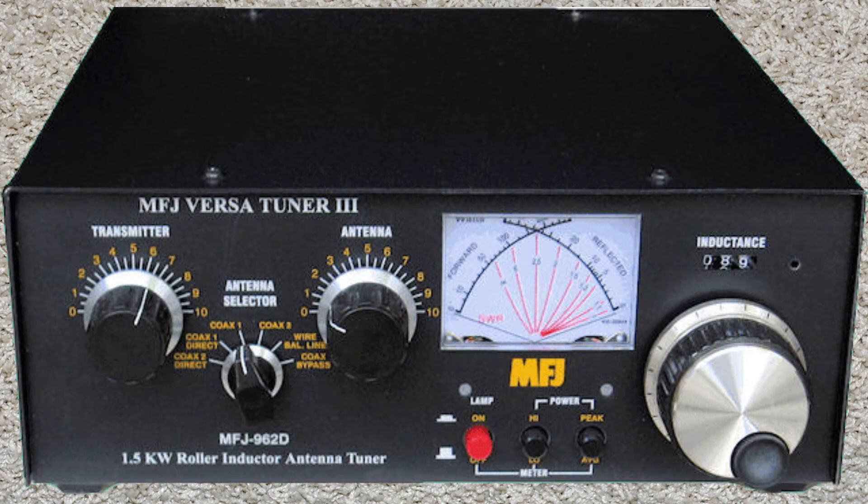Let's tune this baby up. We're going to take the antenna tuner, take the antenna knob and the transmitter knob, and put those straight up and down. The next thing is to turn on the radio and find a frequency that's not in use. Next, turn the roller inductor until we get to the loudest volume. Make sure that your transmitter is on AM and on low power. Key the transmitter, identify yourself with your call sign, and watch the meters.